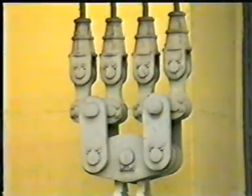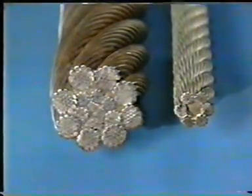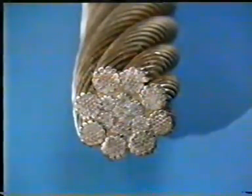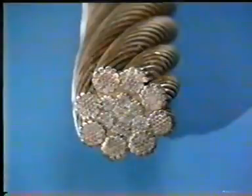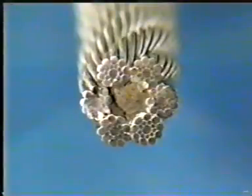The deck is fitted with guide rollers rolling up and down the faces of the towers. The counterweights can be made of steel. Concrete is a factor of three lighter than steel and needs a greater volume to obtain the same counterweight. The cables are connected directly to the counterweight or by an equaliser distributing the same load to each cable. Cables are distinguished by their method of manufacture: Lang's lay cables — called after the Englishman Lang — and normal lay cables. In Lang's lay cables, the wires in the strands and the strands themselves are wound in the same direction — both to the left or both to the right. In normal lay cables, the wires and the strands are wound in opposite directions. The flexibility of a Lang's lay cable is greater than that of a normal lay cable; this is why Lang's lay cables are used in lift bridges.